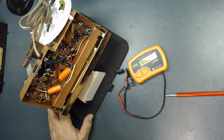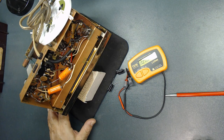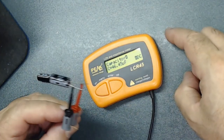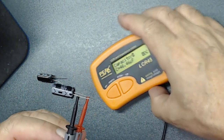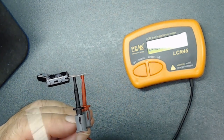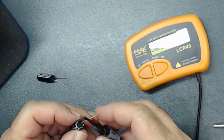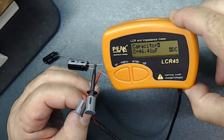I noticed the previous tech installed 160-volt, 47 microfarad capacitors. You can find 50 microfarad, but they're harder to find and much more expensive, so 47 microfarad should work fine here. Always test your new capacitors because some might be defective. This one is fine — note how it marks the negative side, compared to the older one I showed earlier marked on the positive side. This one is fine too.